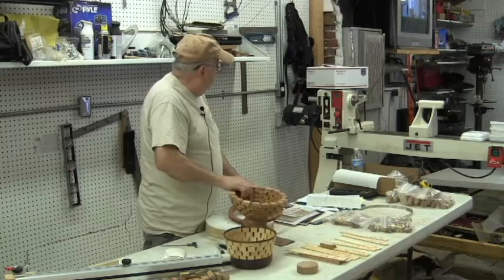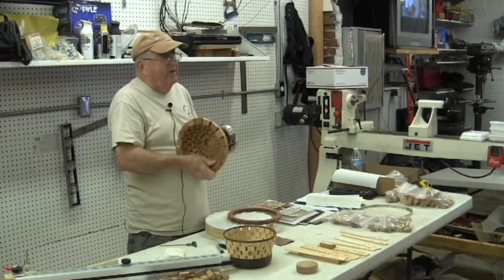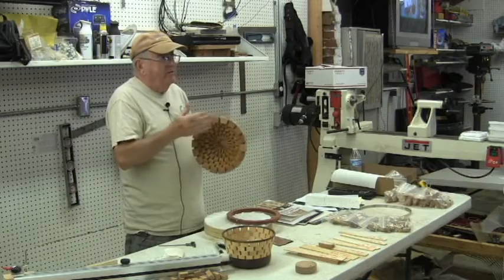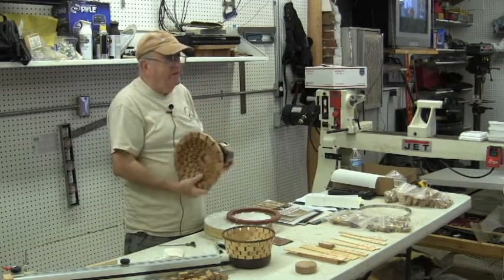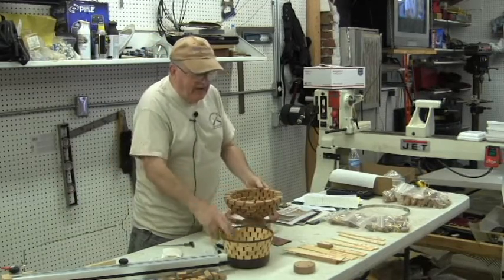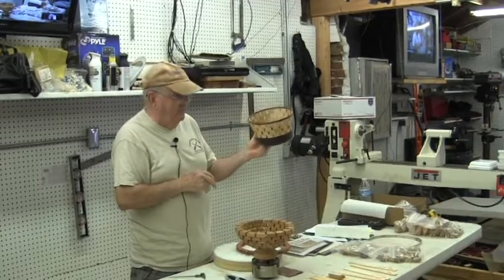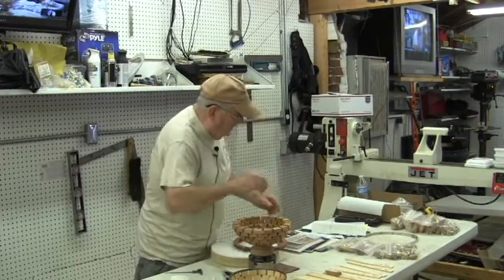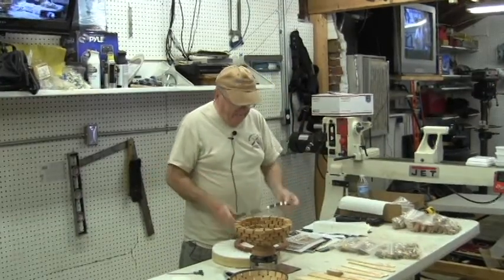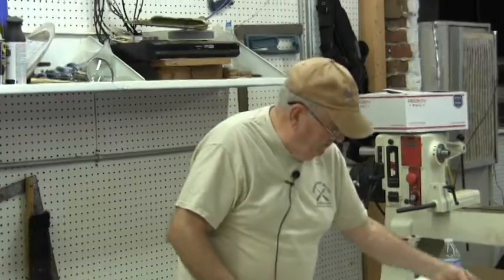Because if I put this on the lathe and turn it on, it's going to look like it's wobbling a little bit because you can't get it perfectly centered. It just doesn't happen. You got glue between the joints, you're going to get some variation. But when you cut it down far enough, you've got a decent looking bowl. All right. Now the one thing we haven't talked about, and by the way, I use pipe clamps to do all my rings. It's just easier for me.